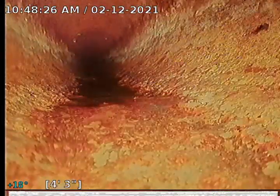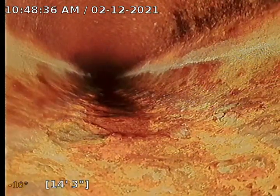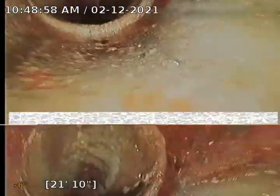Currently right now we're in four inch cast iron. We should have the bathtub running with some water. This is running underneath the house. It looks like right here at 17 feet we're transitioning to four inch terracotta clay pipe. There's a minor offset there at a 45 degree angle.